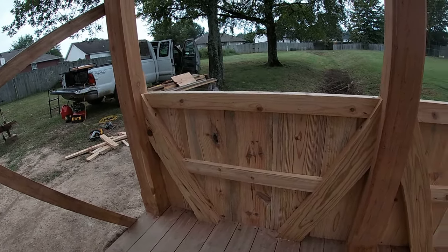I've got the framing up across here. This just gives me something to screw the boards to. I actually had three places to run the screws in. I'm using a 2-inch screw because I don't want the screws to come through on the other side. And I'm screwing into the girder. You can see I've got a little ledger. It's just a piece of cedar, and I'm holding it down an inch from the top of the girder and just screwing into the oak.